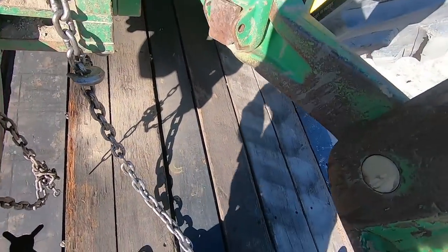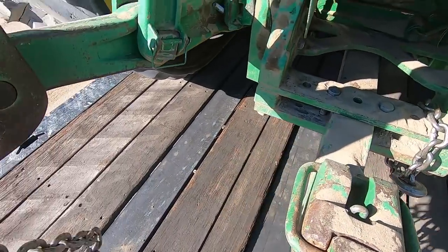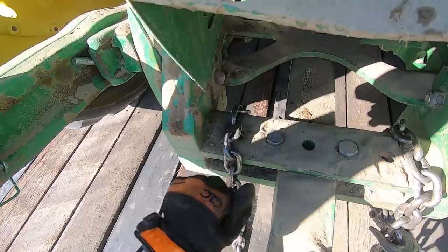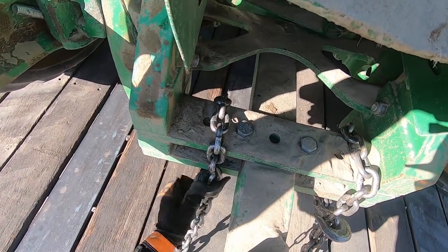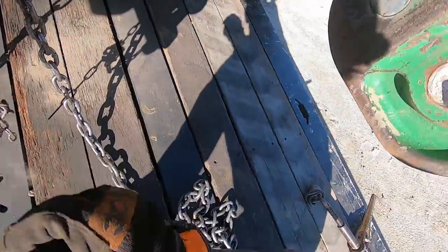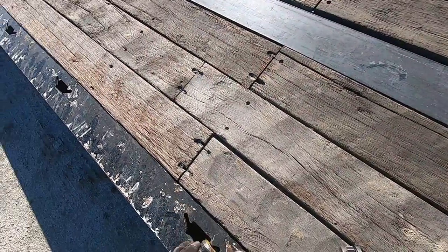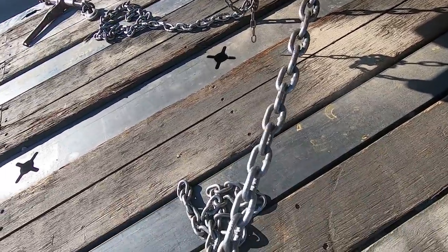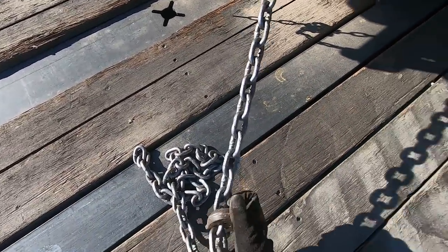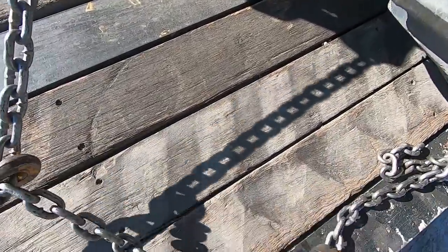A lot of times in equipment hauling, you have to kind of figure out and think, if this is strong enough to, for example, in this case, pull a 50, 60,000 pound planter through the mud and stuff, then it's a good restraint. Because a lot of stuff, they make it so heavy duty that it doesn't even have dedicated chain down points.